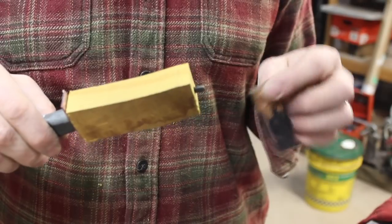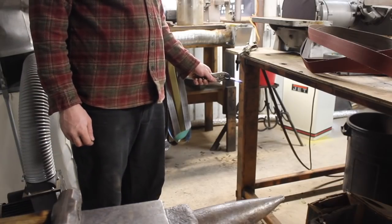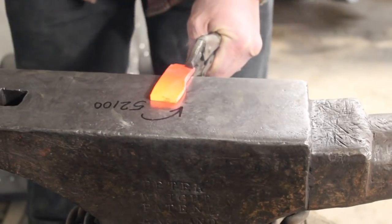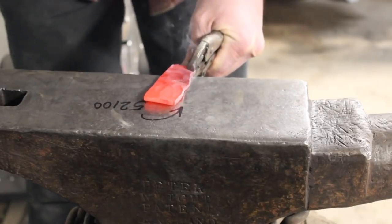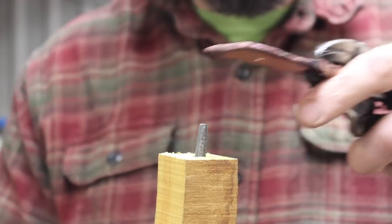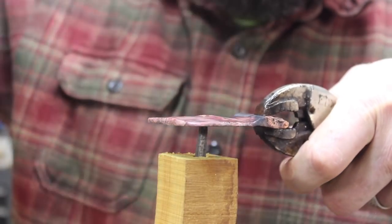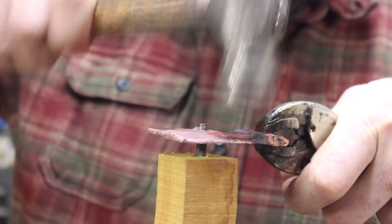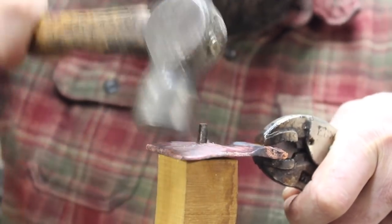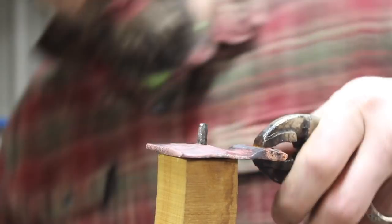The main thing chromium does is slow diffusion, and that slows the necessary quench time when hardening the steel — which is actually a good thing. Take 1095, for example: it has no significant alloying components beyond manganese, about 0.95% carbon and the rest iron. To fully harden 1095, you have to bring it from austenizing temperature — about 1,475 to 1,500°F — down to about 900°F in less than one second. That's a very fast quench needed to keep it from transforming into pearlite, a ferrite-cementite mixture that's not a good blade material.